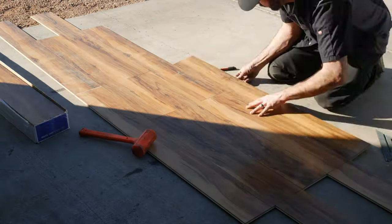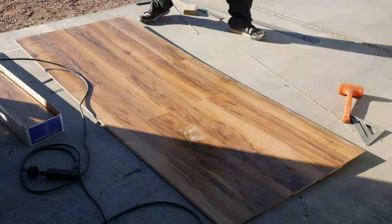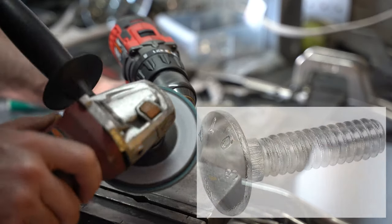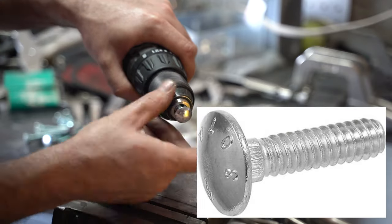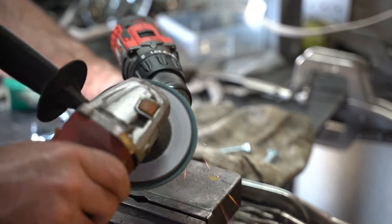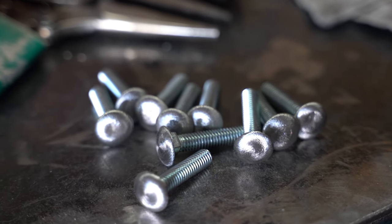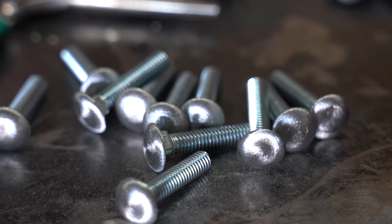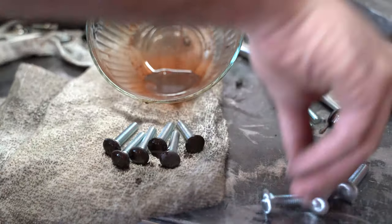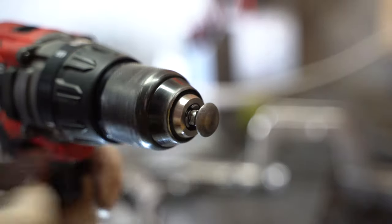I'm not going to get too detailed on the wood backboard. I had a couple boxes of wood flooring left over from another project so I glued some of those pieces together and cut it to fit inside the frame. I decided to bolt the wood to the frame using carriage bolts because they kind of look like rivets. Carriage bolts come zinc coated a bright silver with numbers on the heads. I decided they should match the frame, but applying the Sculpt Nouveau directly to the zinc created some strange results, so I removed the zinc and numbers by chucking the bolts in a drill and hitting the heads with a flap disc. Adding the patina to the bare steel looks much better, and of course I had to scuff the heads with Scotch-Brite.